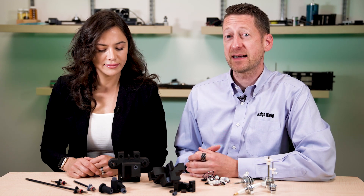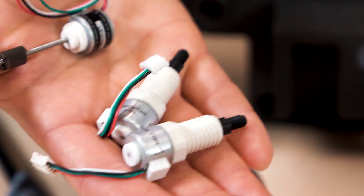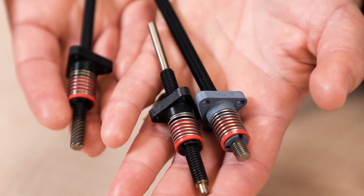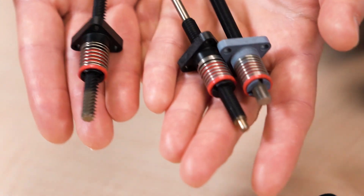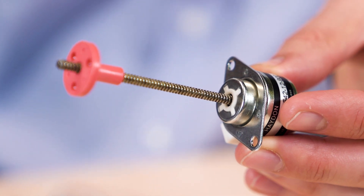Plus, they offer compactness from tight integration. In a lot of cases, these actuators are built around small stepper motors. Polymer nuts excel here because they complement the actuator's lightweight and small footprint, plus employ lubricious materials that reduce friction between the nut and the lead screw shaft that it rides against.